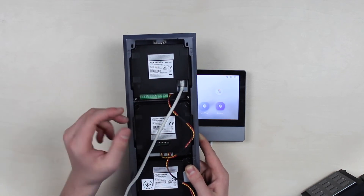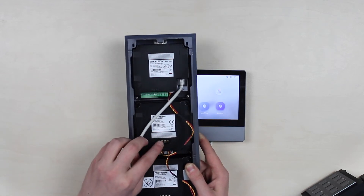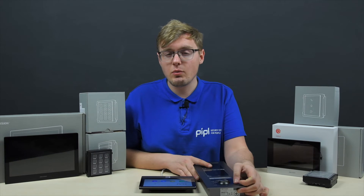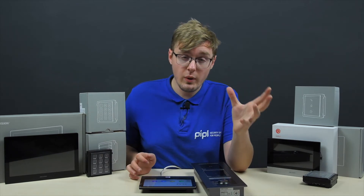On the back side, it is actually unexpectedly simple. We feed power and network to the main module via PoE from a switch, and then paired it with the two modules, powering them via RS-485 from the top main intercom unit to the middle and bottom modules via cables. In the end, we set their positions on the dip switches on each module. Then came the setup stage, which was very simple — but that's a topic for further videos.